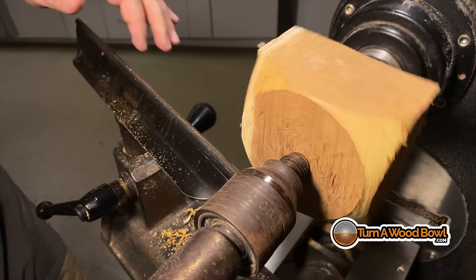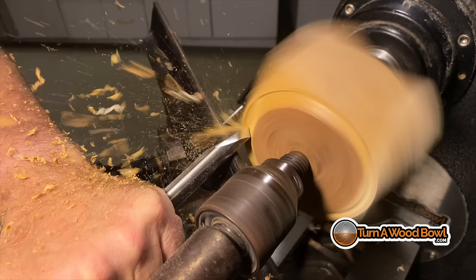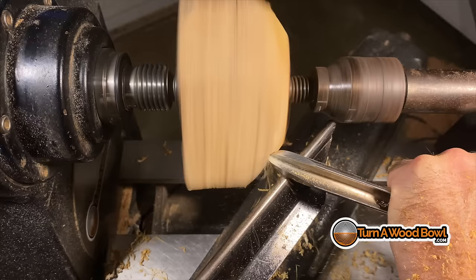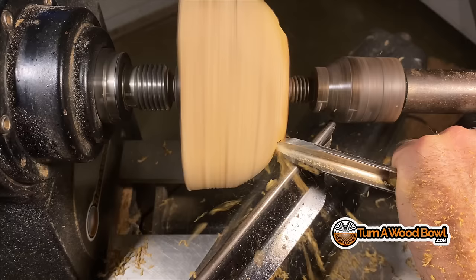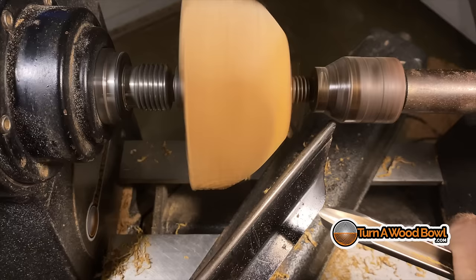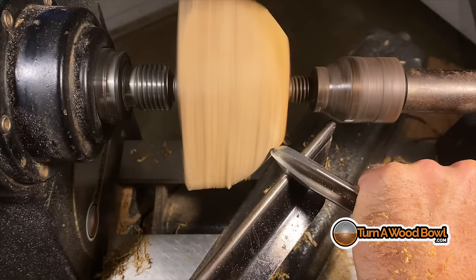I'm shaping the outside of what's going to be a bowl, and we're going to try something different here. Mulberry is a really beautiful wood — it has very tight grain and a nice yellowish appearance when it's fresh. Of course it'll dry and become a little bit darker brown, but that's true of most woods. I'm just shaping this curve now. You can clean up the face and edges to get a perfect cylinder first, or you can just start going at the corners like I am here, paying attention to the shape that's occurring.